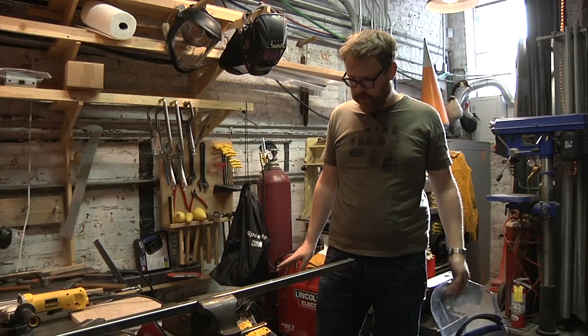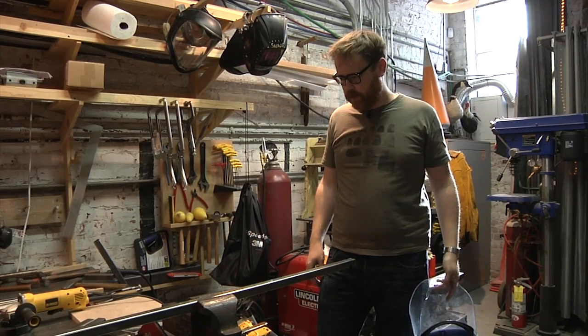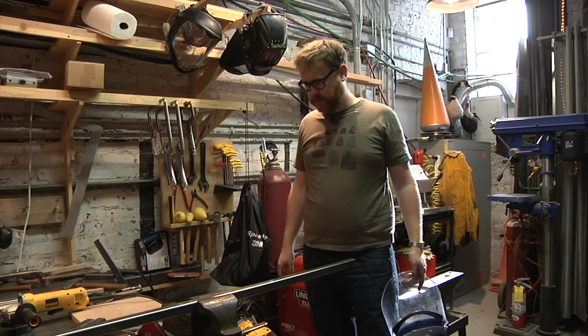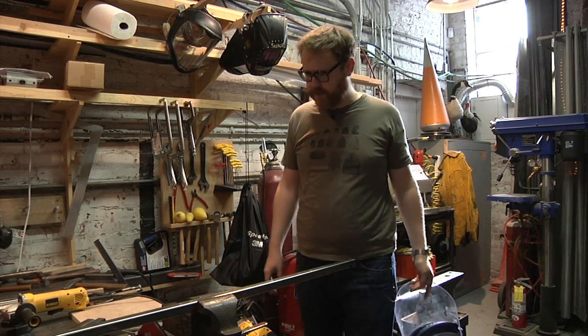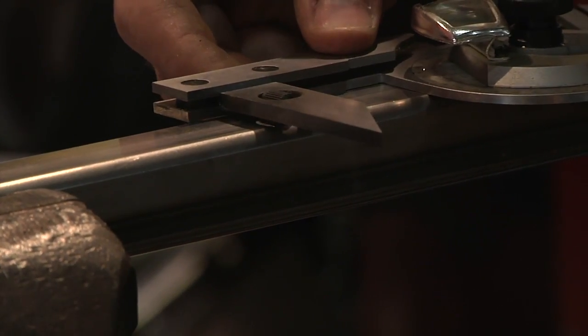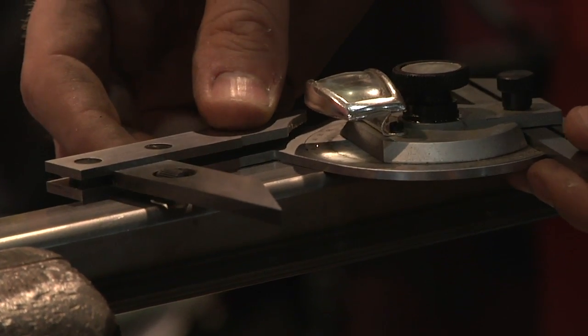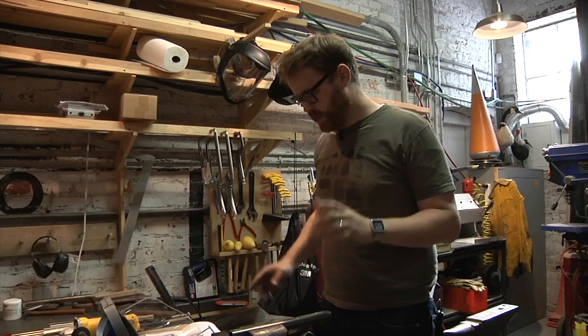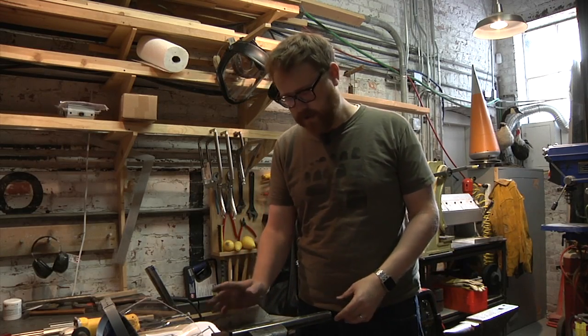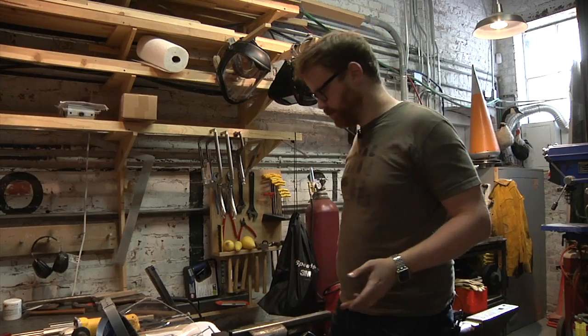Okay, so now I have all the pieces for the big box. So I can go ahead and start welding that if I want, or I could tackle cutting the angles on the 7 strut pieces, I think, right? Because I'm cutting angles, I'm cutting essentially trapezoids because I have 2 parallel sides and then 2 sides that are cattywampus to each other. And I need to make sure that I don't use the long side for the short side, or I may not have enough material.